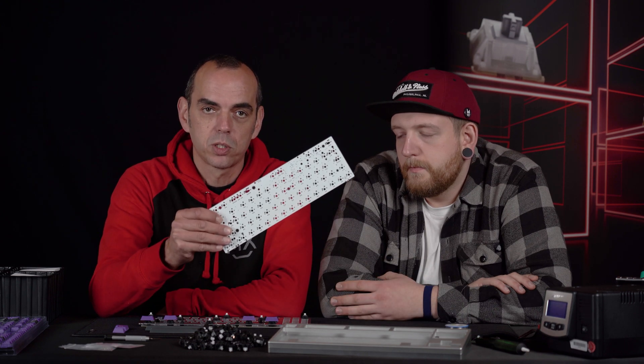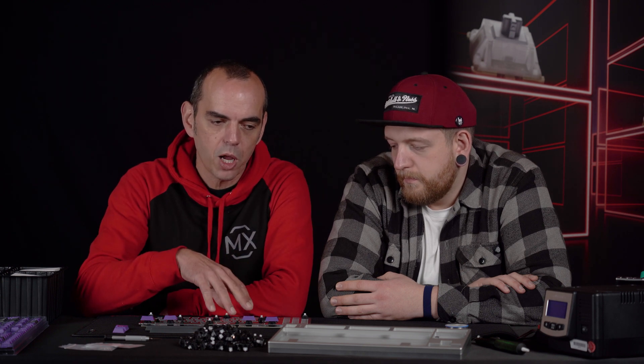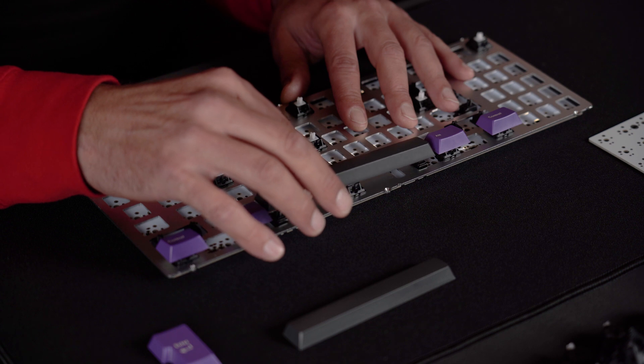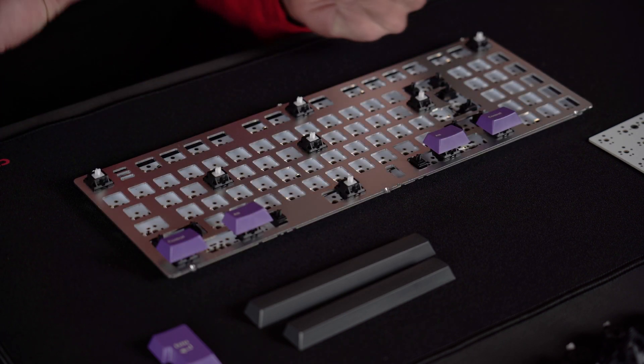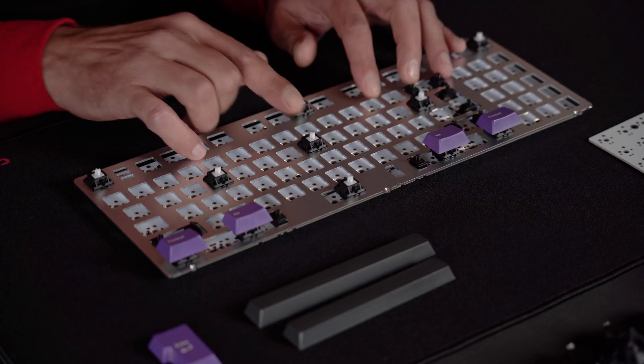Before you start soldering, you have to arrange your keys within the PCB. As mentioned in the last video, this is a multi-layout PCB, so for some keys there are several options for placement. The easiest way is to do it with your keycaps and the frame. Put in some keys for the bottom row, choose the right spacebar since there are different sizes, assemble the keys and test with the frame to confirm the position is correct. Then you can put your spacers and stabilizers on the PCB and add some keys to make the adjustment right.